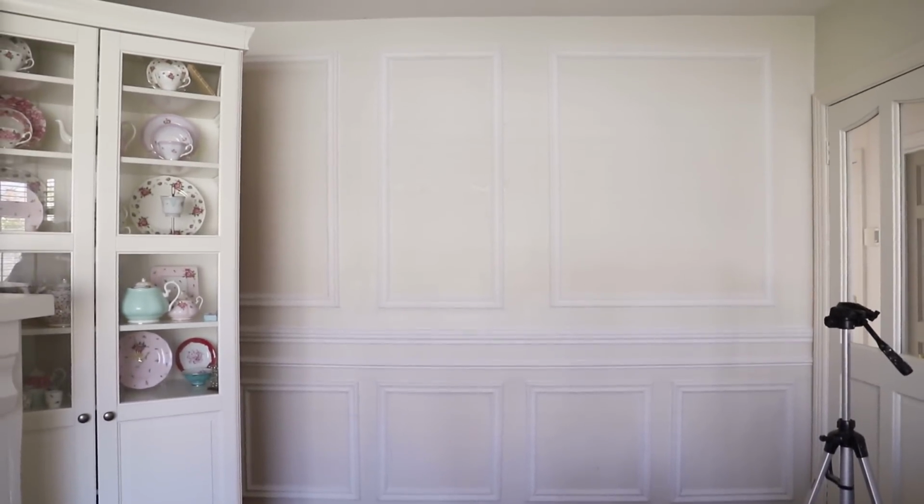So this is how it is looking. I'm just waiting on the caulk to dry. Oh, and I'm also gonna have my lunch. So the last one is in here. It's all caulked and the crack as well. I think I realized why I have a crack. There's a really slight curve in the plaster in the wall, like really slightly. I only noticed it when I was putting this one in. Of all the pieces on top, this one I just used my nail gun to tack in the end because it kept flipping up. So I was like, I wonder, is that why the plaster is cracking a little bit?